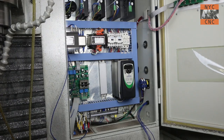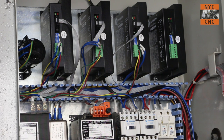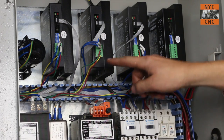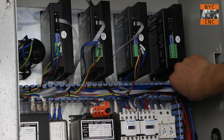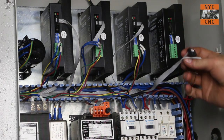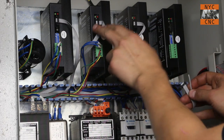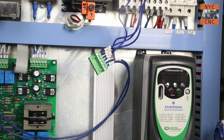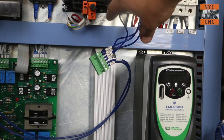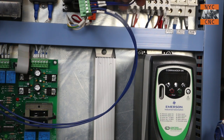Strip about one eighth of an inch off the end of each of these four wires and then snake them through the blue cable carrier. Don't put those covers back on just yet. We need to plug in the equivalent of this cable — they just sever it off at certain points — so find the gray cable, you'll see it should be tucked in here. Tug and sure enough, there she sits. The last thing I think we have to wire up is the terminal block connector to the actual controller. The blue wires are from top to bottom starting up here: 320, then 321, 322, and 323 — so those are all progressive and normal.